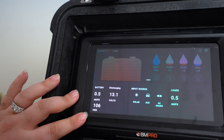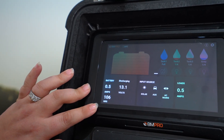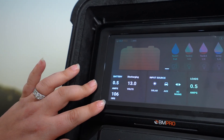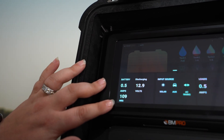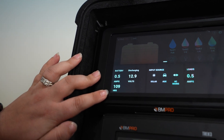In the power information it gives you an indication of the time remaining. This is directly linked to the state of charge of your battery, but it's not an exact calculation — it calculates to the low voltage disconnect level set in the system. The time remaining is linked to state of charge but doesn't indicate to the full capacity of the battery; rather, it reflects the low voltage disconnect level of the system.